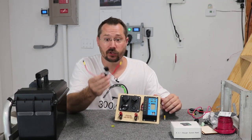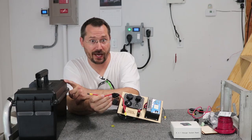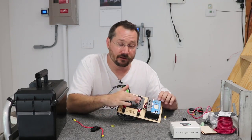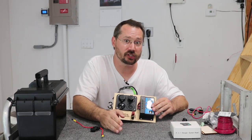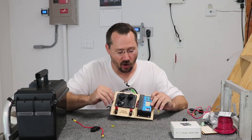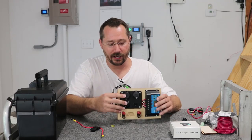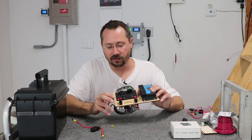To do that, we're still going to use our fuse holder. On one end we'll have our female spade crimp-on connection going straight to the battery's 12 volt positive. On the other end, it's going to go to the middle connector on the switch, and then the switched output from the switch is going to go up to the battery plus terminal on the solar charge controller. The other change is that the load output — represented here with the little light bulb and the plus — that red wire goes out to our cigarette lighter plug, our USB connections, our voltmeter display, and also our 12V jack.